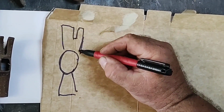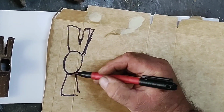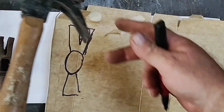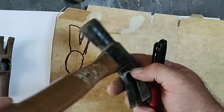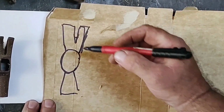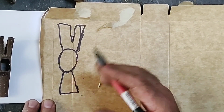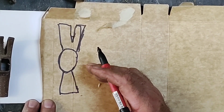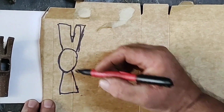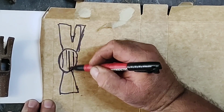Okay, so this is your claw hammer. Like I say, I'm a real artist. This is your claw, and this is the end of the handle. So what I would do, considering that when you use a claw hammer there's going to be a lot of levering like this, and not so much side movement like that at all, I'm going to want my grain to be strongest from front to back, from the hammerhead back. Now, in saying that, you've got to have a little bit of flex too. You can't have total rigidity, but timber in itself allows some flex. I would have a tendency to go front to back grain like this.